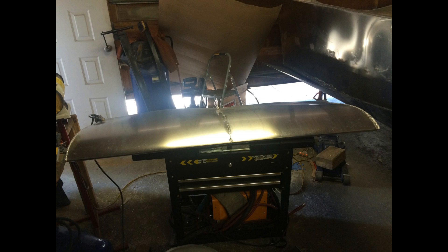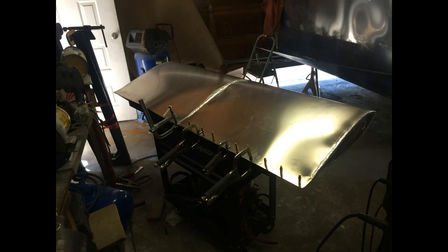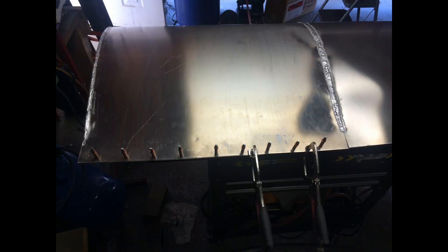The problem was a welding problem. The amount of heat required to weld it to that middle rib warped the thin aluminum sheeting. Maybe if I was a better welder, or took more time and was a bit more patient with it, I could have got a better result. But you can see here there's a bit of a warp — you can see it in the reflection at that middle there.